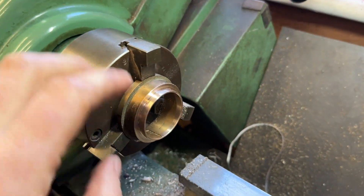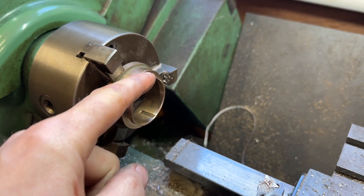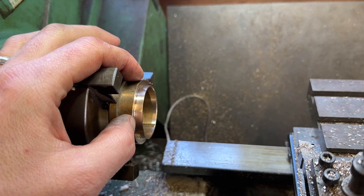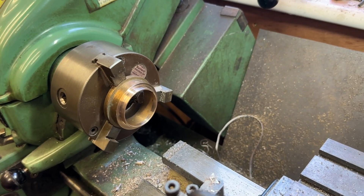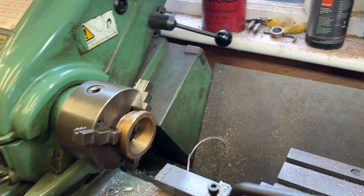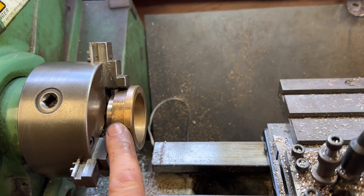There we go — I've machined the inside as you can see. It hasn't gone that far because of the taper, and I've machined the outside which should go inside the register on the engine. The idea is it goes right up inside, and the only way you'll know it's gone all the way up is if you can see a gap here. Hopefully with the leading taper it has, we won't even need to compress the rings to get it started — we can just push it through and the rings will compress and push into the bore. I've decided to take the shoulder off the outside just in case there are any clearance issues around the engine, but I'll still leave it the same length.